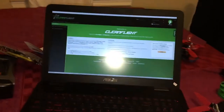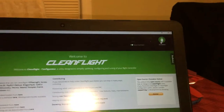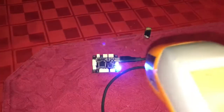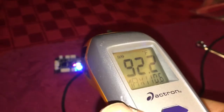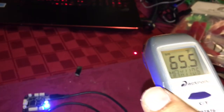I have Cleanflight open and I'm going to plug it into the computer. There's nothing on Cleanflight — it doesn't want to connect. I've already tried reflashing it, but that's when I noticed it almost burned me, because it is currently hot to the touch — 110 degrees on the board, and the background temperature is only about 65.